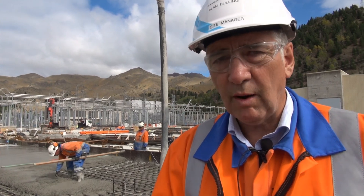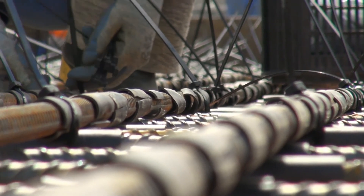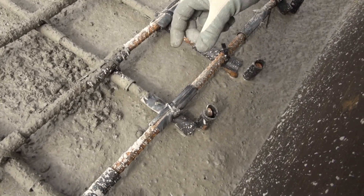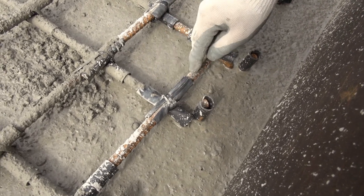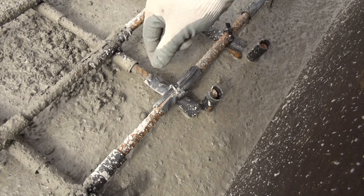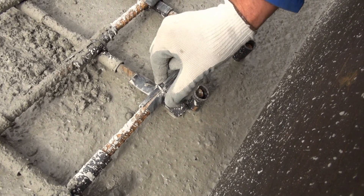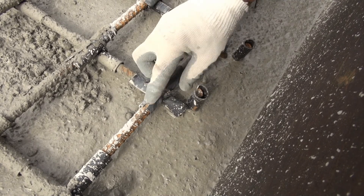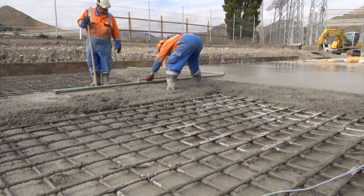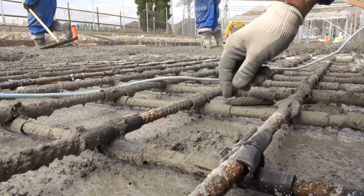There's been a lot of work and it's all tied with cable ties — there are no steel ties at all on the slab here in the filterbank. You can see the top bar and the bottom bar are both fully insulated and tied with a nylon cable tie so there's no circulating current between the top and the bottom. Every crossover is insulated that way, so it's basically double insulated in all directions.